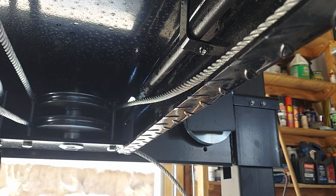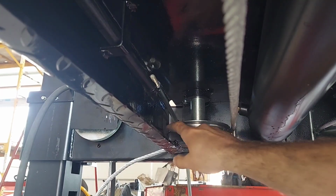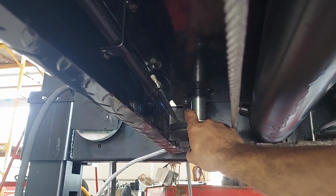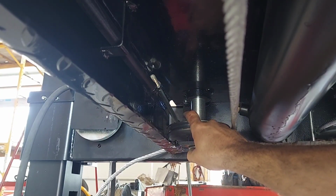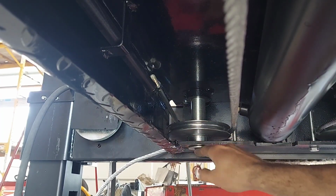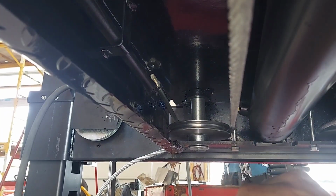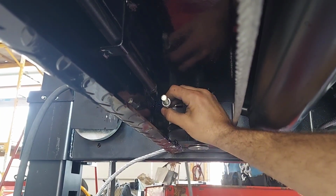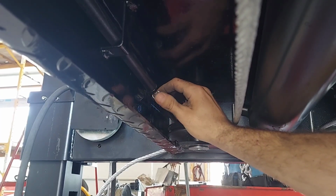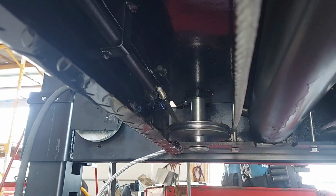You may need to hold it with the vice grips. Do this on both ends. Sometimes these cables get stuck down underneath the pulley, so you have to get up there with a number 8 Allen head and just a ratchet wrench to fit right in there and loosen that screw up there so you can drop this pin out, get your cable oriented around the pulley, and good to go. Then you want to put your locking rod through the hole, put the nut back on, and thread it into there, but do not tighten this yet. We'll tighten that later on both ends.